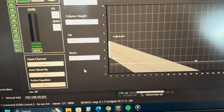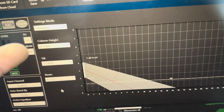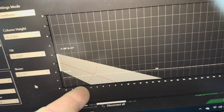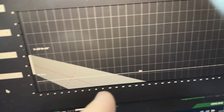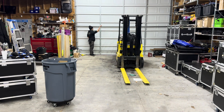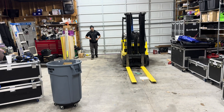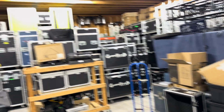In this scenario, we're going with what we're doing for the install. We're going to be hanging at roughly 2 meters, with a tilt of 20 and a beam of 15, which should make us start at around 2 or 3 meters and carry all the way down — keeping the sound off the back wall as long as the church would be right here. Tanner's going to start talking and walking toward the speaker with a Countryman E6.